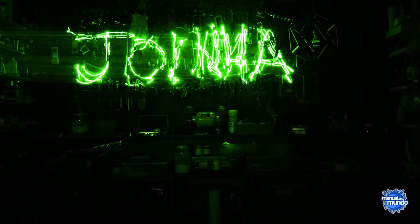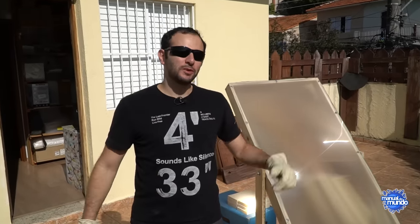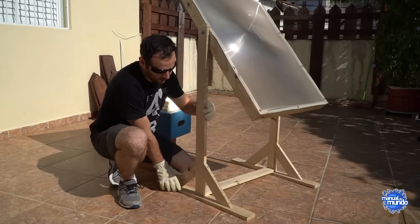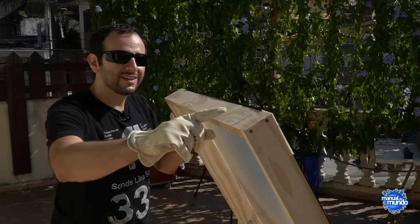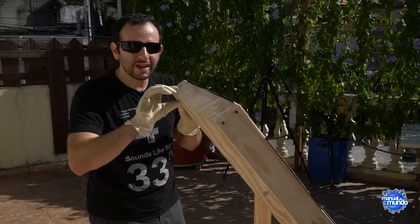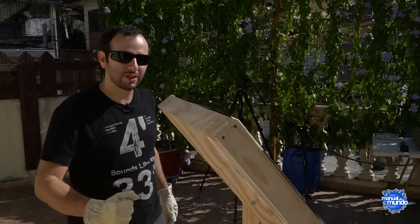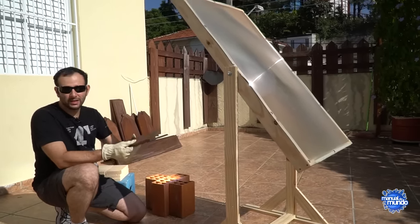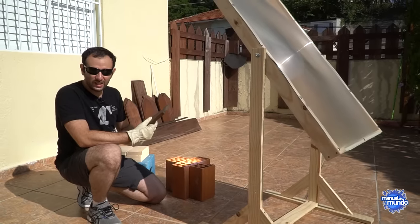It's 10 AM and the weather forecast is sunny with absolutely no clouds — the right day to test this. Positioning it is very easy. First, align the frame in relation to the sun by making the shadow coincide on top of itself — at the threshold between sun and shadow, it is exactly in the same direction as the sun, with the lens 90 degrees relative to the sun's rays. To find the focus point, take a piece of wood and hunt for it — you'll see it's very easy to find. I'm using welding glasses so I can look at the intense light that will appear.